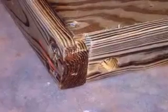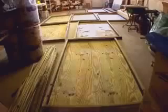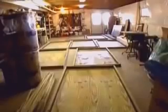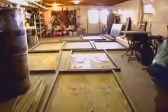For building the boxes, I cut a rabbet in the back of each pressure treated 2x4, then drilled holes where the headers will exit the sides of the panels. I assembled the boxes with screws, including the plywood back, which fits into a rabbet in the back of the 2x4s. Each box also has three 2x2s running across the back of the panel, which supports the copper core solar panel and strengthens the plywood back.